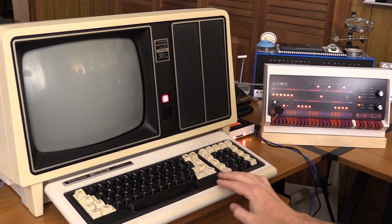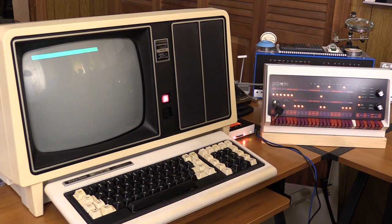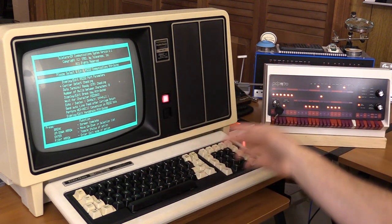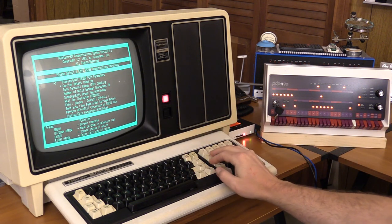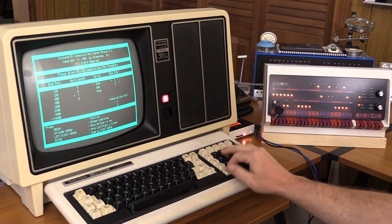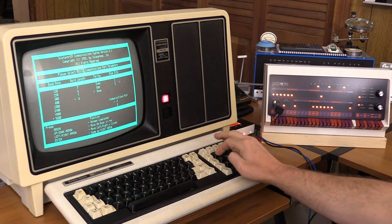All right, communications. This terminal program lies, by the way. If you turn off CD checking, it still won't actually talk to the thing, even if there's a terminal on the other end. But now that I fooled it, it doesn't really matter. So let's go in and set our parameters. I've got this set to 9600, 8, none, oops, and 1.